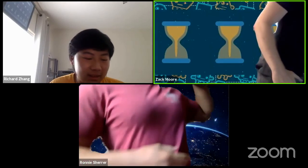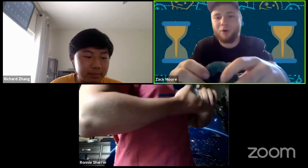What was the coolest thing you made with 3D printing? We actually went through the process on FrogForce of over-molding silicone and urethane onto 3D printed parts. One of the wheels shown earlier is a PLA hub that we over-molded silicone onto for an intake wheel because we thought silicone gripped the totes better. We didn't have the money for a super expensive Fairlane wheel, so we bought mixing supplies for about $30 to $40 off Amazon, printed a hub for maybe a dollar of material costs, and over-molded the silicone onto it. We also ran a lot of swerve stuff inspired by Strike Force, who were over-molding Mark Forged wheels — we'd print a tread pattern in PLA, do a mold of it, and cast the tread pattern in urethane with a key to attach to a Mark Forged part.